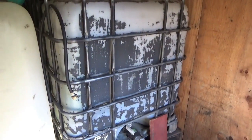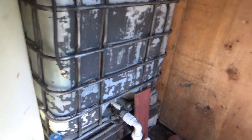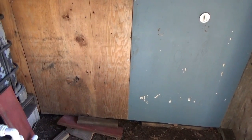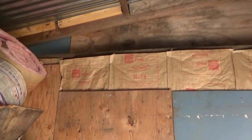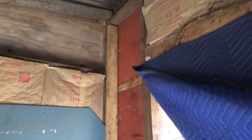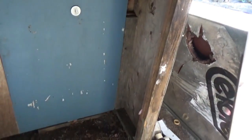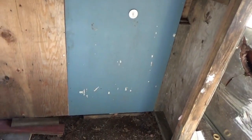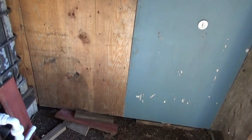Good afternoon everybody. I am putting in the walls here in the watershed — the tiny house off-grid tiny house watershed. It's taking a long time because I have to cut in pieces from mismatched junk. I have to put a one-foot strip up above and then still do the triangular gap. I just put in some nailers in the corner — some scrap 2x4 lumber — and then I'll put the insulation and put the sidewall on. Eventually we'll be getting the wood stove in here tonight.